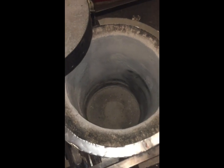So it comes through that duct right there, and it swirls inside the furnace. And the furnace height is calculated so that I can get as much combustion inside the furnace as possible before the flame is ejected out the top through that hole. And then as this swirling effect happens, there's another hole, which is my bleed air hole, which is right there, which goes back to that side duct there, which will be injected for preheating the oil. So that's the idea there.